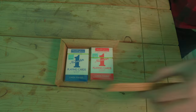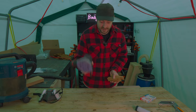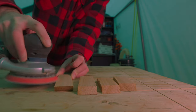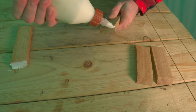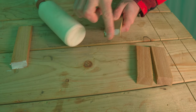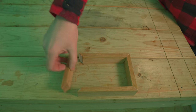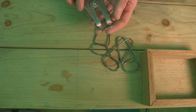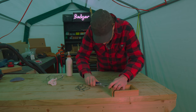I've got four sides cut but before gluing them together I'm going to give them all a sand down. I can now get some PVA wood glue put onto the joints, spread out, and get this thing put together. To hold it together I'm going to use some of these Collins clamps — I love these, and there's a link to them down below on the tools I use page. Then I've just got to leave it to dry.